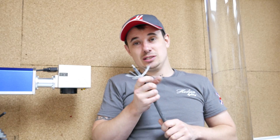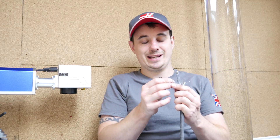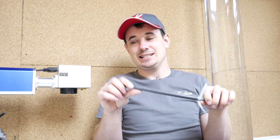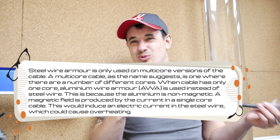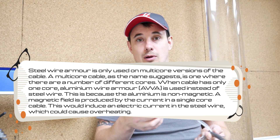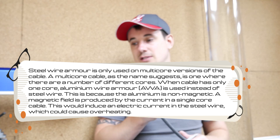SWA, commonly known as SWA, actually stands for Steel Wire Armoured. The steel wire part comes from the steel wire that goes around the outside, and 'armoured' comes from the fact that it's quite tough. It first appeared in its current form as a PVC cable in 1969 under BS 6346. Before that it would have been tar and hessian, tar on paper, or even lead sheathed. There are still plenty of really old submains out there that consist of VIR and similar. It's a strong and robust cable.